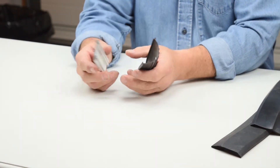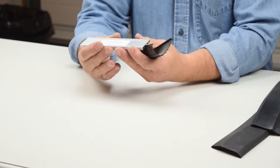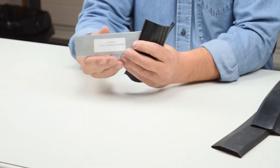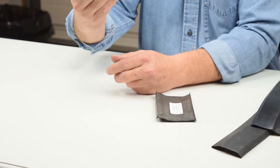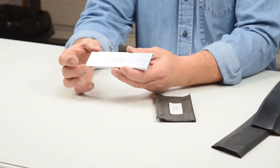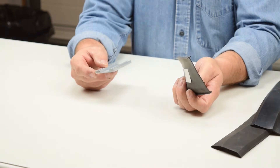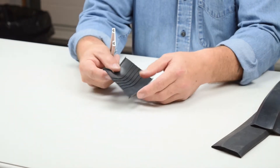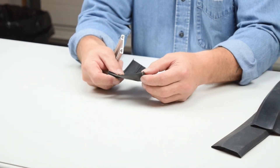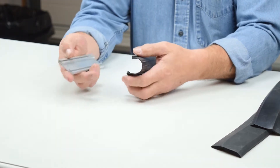Now here's the upgrade. We have different width retainers where you basically remove the old seal, scrape it, pull the nails out, and then this goes on the bottom of the door — you drill holes and screw it on. What we do is put a couple of beads of silicone on here, put that up on the door, and then screw it tight. We have it in various widths. It accepts a quarter-inch T-style weather seal. You're going to see that we have quite a lot of options for the quarter-inch T on our website. So you get the retainer installed on the bottom of the door.